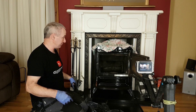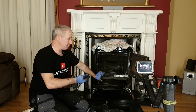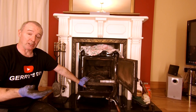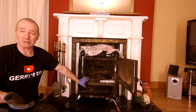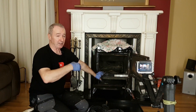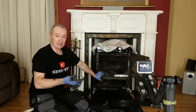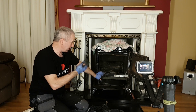Nice and slow with this because there'll be clouds of dust in the room. Rotated it clockwise all the way up and clockwise all the way down - that way the rods stay intact, otherwise they'll unwind. I've had very little soot out of the chimney, which is fantastic - it means the stove is burning well. I do burn wood, coal sometimes, whatever - solid fuel. It's a multi-fuel stove and I burn multi-fuels in it. Sometimes I burn vegetable oil and sawdust, but I burn them hot. If there's no smoke, smoke is unburned fuel. You want it nice and hot so you're not getting smoke out of your chimney - a bit like the waste oil burners. When I burn them there are no clouds of smoke going downwind. If I get a good roar, it's burning clean.